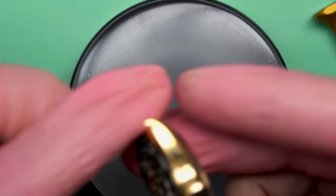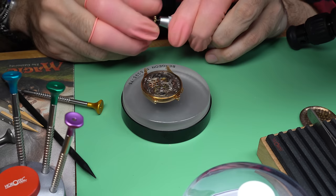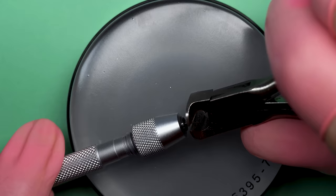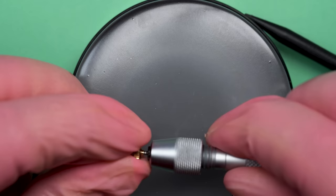There's a bit of a gap with the crown — that just looks terrible. It would be functionally the same, but I'm not going to leave it like that. What we need to do is trim down the stem underneath. After measuring carefully, the end cutters will take off just the tip of it. Unfortunately it will get burrs on it, and that can tear up the crown since it's just made of brass. So we do need to round off the burrs and make sure it's nice, and then we can put it back on and get a better fit.